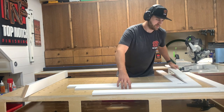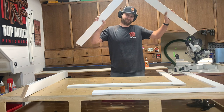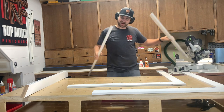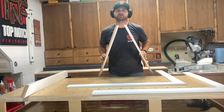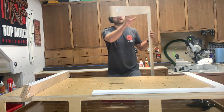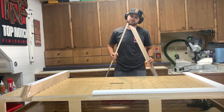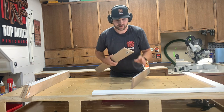Instant bond — I wasn't too happy with it yesterday either. Just going to lift up. Oh, way stronger with two stripes of glue! Holy crap, this is good — this is really good news for me. That's what you want right there. Running two stripes — wow, that's exactly what you want. Instant bond with the clam clamp is useless; we won't be doing that. Still, way better than the Titebond — it ripped fibers out.